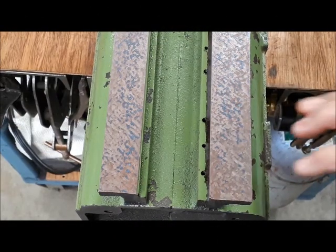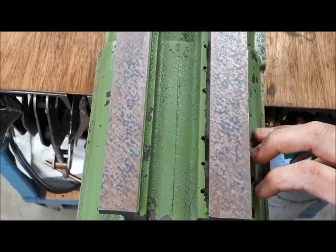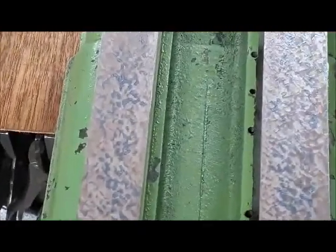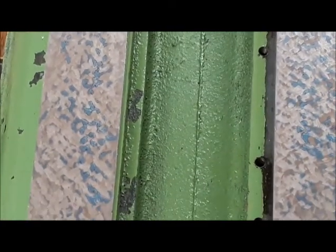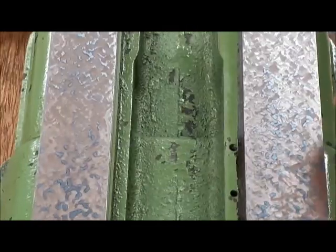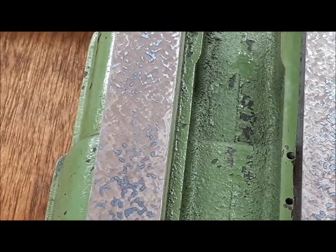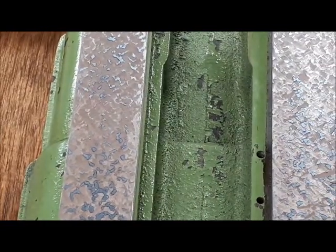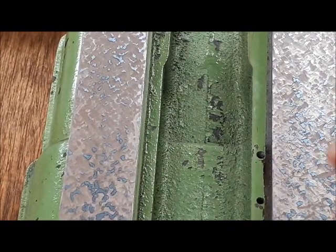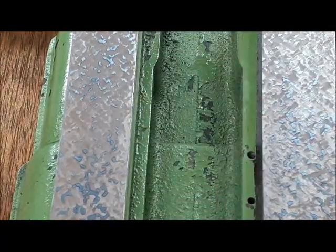If you concentrate on knocking those big high points down, the whole surface drops. You can see here this last bluing picked up a lot of material, and I could feel that in the way it was moving on the plate. Getting close on both flatness and bearing surface. I used Jeweler's Rouge as a background, which helps the blue pop. As you get closer to picking up high points and trying to break things up, it's easier to find those points when you have that red background.